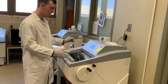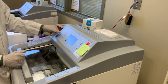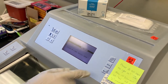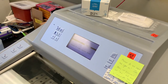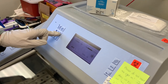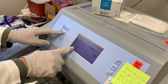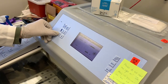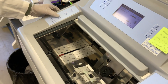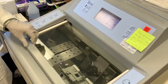When you're done with this machine, we want to turn the light off. When I start sectioning, the light turned on automatically, but we want to turn it off. Go to menu, scroll up to illumination, hit the down arrow, and turn it off. Then menu to exit. The controls for sectioning: this button with the thick wedge and thin wedge allows you to switch between fine and trim mode. These arrows allow you to change the thickness. Inside the machine, these two arrows allow you to bring the chuck holder towards or away from the stage. Remember to close the sash when you're done.